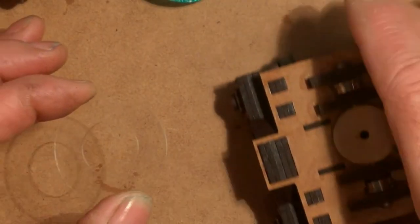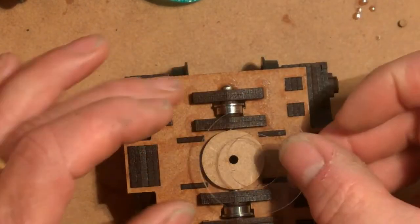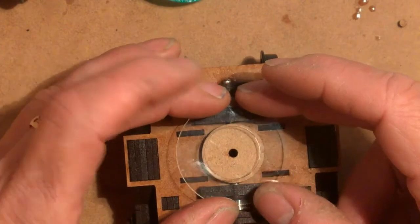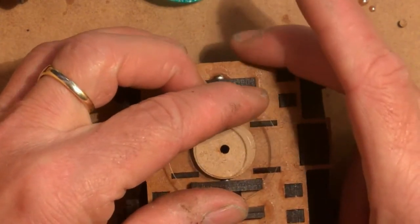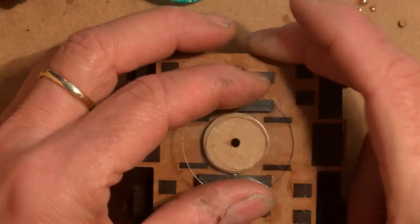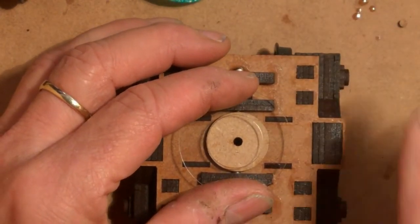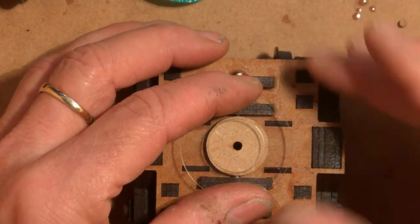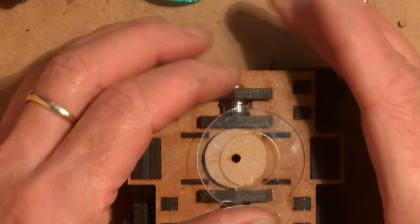And then if we bring in the other bogie, because the bearings are at 90 degrees to this one, again we still have the same facility to rotate, but in this case it can't go that direction, but it can rotate in that direction. So that means the actual low loader itself is very, very stable. That's the principle of the bearing system.